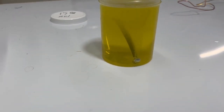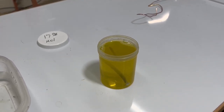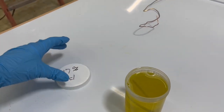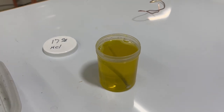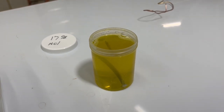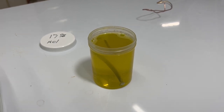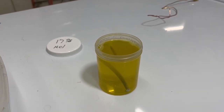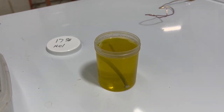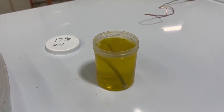As you notice this part is just slowing down the bubbling. This is the indicator that this solution is about done doing its job. We often get asked where you can find the hydrochloric acid. There is a solution called muriatic acid. Home Depot and Ace Hardware are common places to locate it. The important thing is that it is diluted and you are going to add the acid to the distilled water. It's very important that you add it properly, otherwise the chemicals can react.